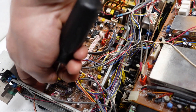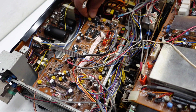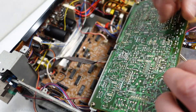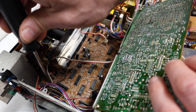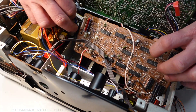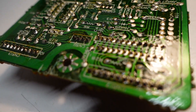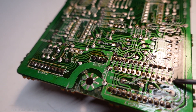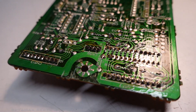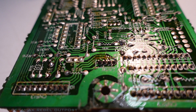I'm going to have to take out the whole RC14 board and see what's going on. Unfortunately, I've got to come back in here again and get the preamp board out of the way. This time I'm going to remove the entire RC14 board. CN519 pin 12 — the pause button. This is definitely bad. You can see how it's dry and cracked. So that all needs to be reflowed. This whole line should be reflowed. The rest of it looks good, but this doesn't look too good.